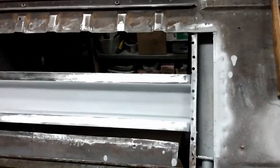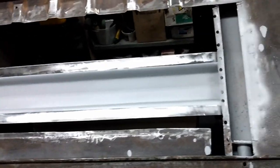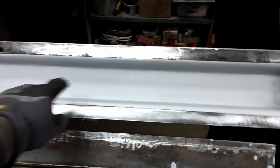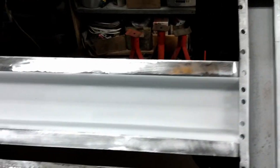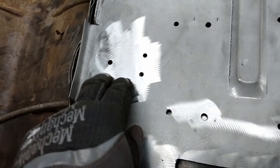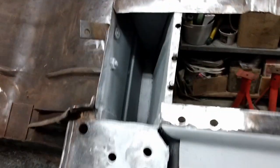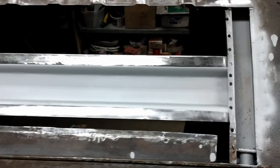We're all prepped and ready to start welding in — everything's cleaned up and alignment is really good. You can see I've sprayed some zinc primer inside the cavity here. I didn't paint these flanges because I wanted to make sure I got a really positive weld through all the holes in the panel — those will be the plug welds that go through each of those flanges. I've got holes started over here where the spring plate all gets bolted on, and once I get it in place I'll just enlarge them as necessary with a round file. Next step is to get this floor pan finally welded in.